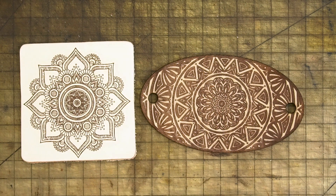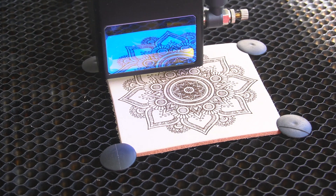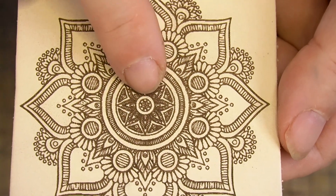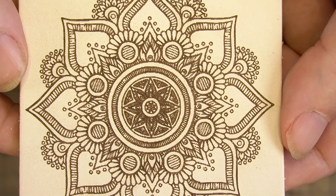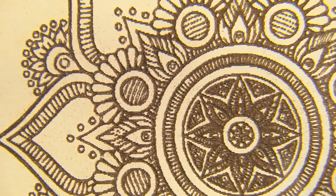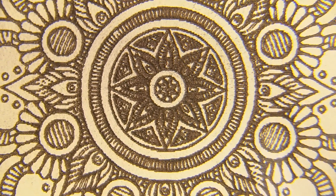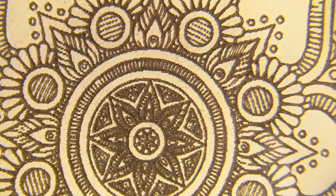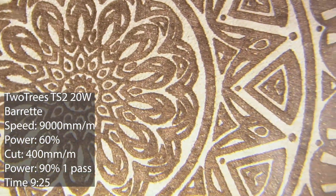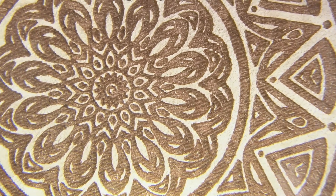This is the Two Trees TS2 20 watt laser. According to its stats it has a 0.05 to 0.1 millimeter spot size. Let's go ahead and take a deeper look. This is how this laser portrayed the artwork to the naked eye — now let's go deeper with the magnifying glass. To me there's no comparison to a laser with less wattage and a smaller dot size. If you're engraving a piece of art that doesn't have as much detail a machine like this might cater fine to it, but it's never going to match the quality of a smaller dot size.